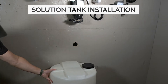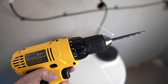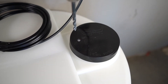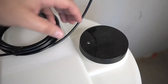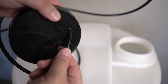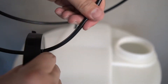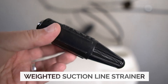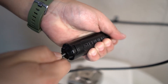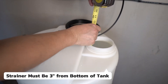You are now ready to install the solution tank. This step will require the suction discharge tubing. Using a quarter-inch drill bit, drill a hole in the cap of the tank — it's recommended to drill offset, which will be helpful when filling the tank with solution. Unscrew the lid and thread the tubing through the quarter-inch hole you drilled, inserting about three feet. Locate the weighted suction line strainer and press the end of the line into the strainer, pushing it all the way in until it stops.